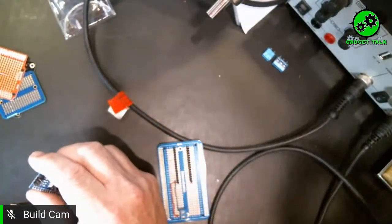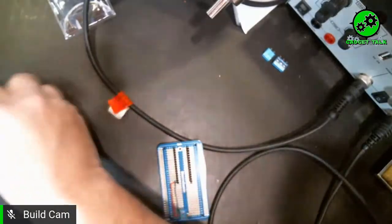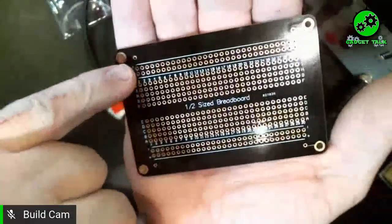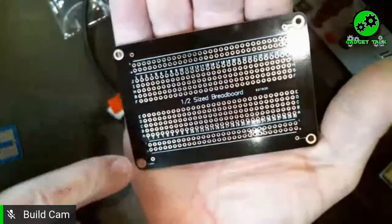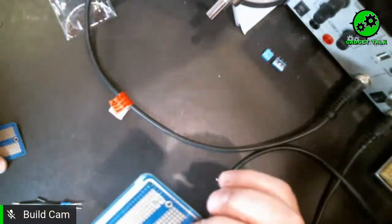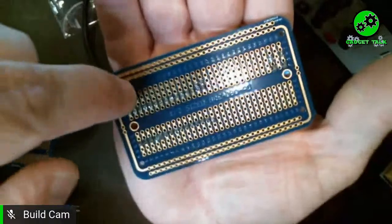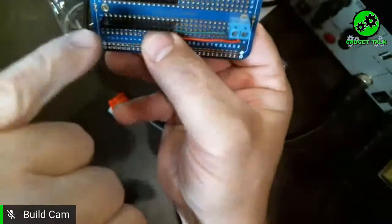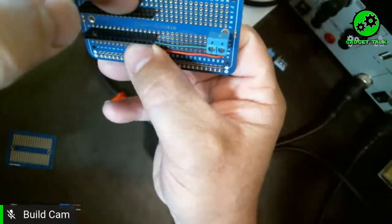And then what I use now is this type of PCB board here. It's more like a soldering breadboard. So you actually have your plus and your minus for your voltage, negative on each side. And then here you can see it's numbered and lettered. If you flip it over, well, that one's not easy enough to see it on. Let's go to a green one for this one here. Everything's connected in that line. So when I solder in these parts for the Arduino, I just have to solder into these right above it here. I have a couple extra holes.